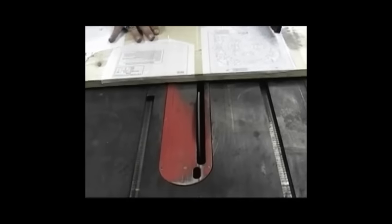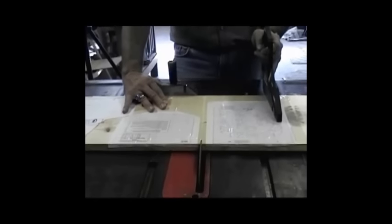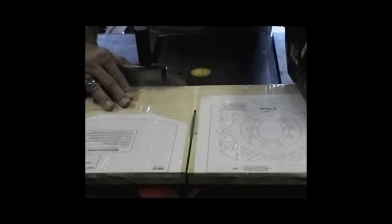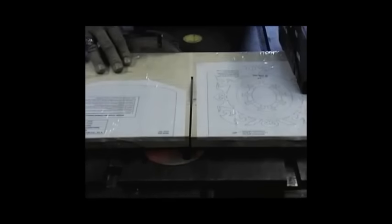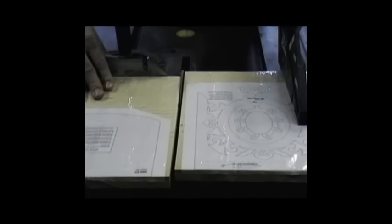Now we're going to cut down the boards into individual work pieces so that they're easier to work with on the scroll saw. You can use a table saw, a band saw, or a fast cutting blade on the scroll saw. Sometimes I'll use a combination of all three depending on pattern location on the board. When cutting pieces, always be sure when you're using the table saw that you use a push stick in order to work the pieces through. You don't want to use your bare hands. That's a pretty fast moving blade there, and it'll ruin your whole doggone day for sure.